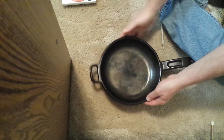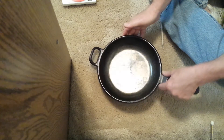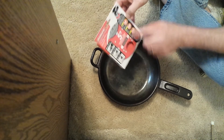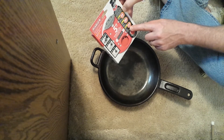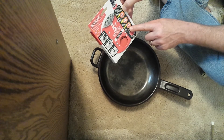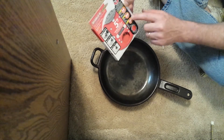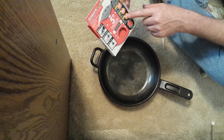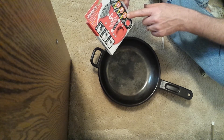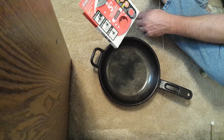After the 60-grit I moved to 100-grit for a while, then finished with 150-grit — this is probably the most important step. When I touch the surface now it is absolutely smooth, glass-like. You may even want to go higher, like 200 or 220-grit; the closer you can get to a glass-like finish the better. The whole orbital sanding process took maybe two hours.